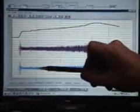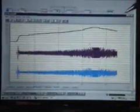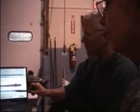The good news is that it is indeed a continuous ramp up as we'd expect, but what you don't get is a real significant drastic increase in the torsional vibration at any point in the driving range. Is that the drive line there? This is the engine, and then the blue one is the drive line itself. So what you don't see is that it's fairly smooth, and to a large extent it's slightly smaller than the engine, so it's doing some absorption, so you're getting some isolation to a certain extent, really right up through the driveline area itself. And then obviously once you come back down, what it tends to do is it actually smoothed out some of those other peaks.